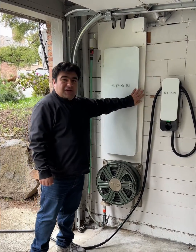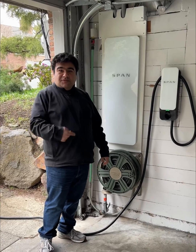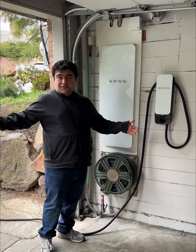So with that, we don't have to dig a trench all the way to the street transformer and have Seattle City Light bring in a whole new service, which will save the customer a lot of money. They'll be able to charge their electric car at home and not have to do a full service upgrade.